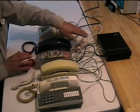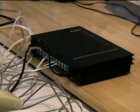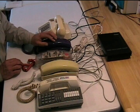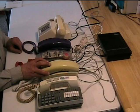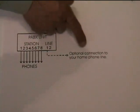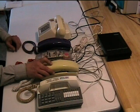So there's your basic setup. On this one it's got two ports where you can hook your household telephone line into it. On this model you have to do a little programming to allow it to access that phone line and tell it what to do if that line rings in — whether you want to ring the phones or have the auto attendant answer the line. Then you can pick up the phone, dial nine, and access the outside line to make an outgoing call. You don't need to connect an outside line; you can just connect telephone lines to it. It requires a three-digit code to dial one of the other stations, though that can be reprogrammed.